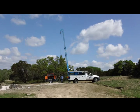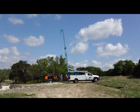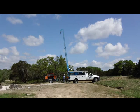Hi, I'm Jim Blair, President of Bee Cave Drilling. If you've been told that your well is dry, you may want to hear about another option. Many of the wells in the Hill Country were completed with only surface casing. That means that you only have casing at the surface, so the hole is standing open below that.